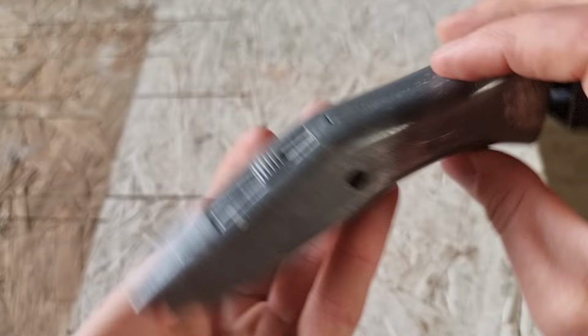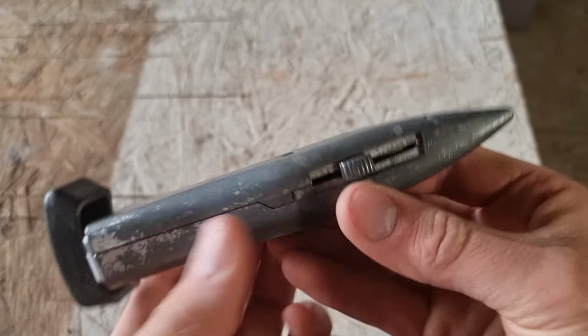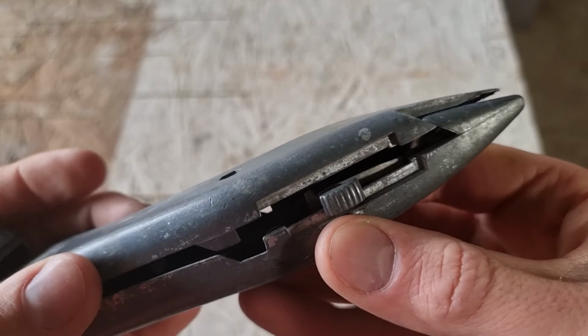In this video, I'm going to show you how to change the blade in a floor layer's Stanley knife or a carpet fitter's Stanley knife. You might have looked at this and not been able to figure out quite how you swap the blade, but in order to swap the blade, you pull this black thing out of the end and you can actually twist that, and you'll see once you twist it, it stops, and that means you can then slide this back. You can see it's notched in. So once you pull the black thing back, you want to then slide that out.